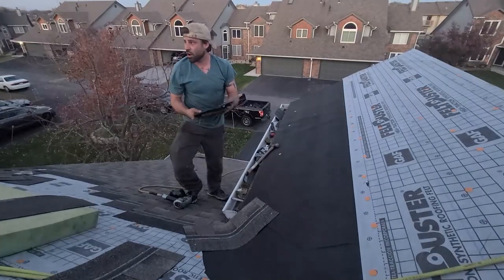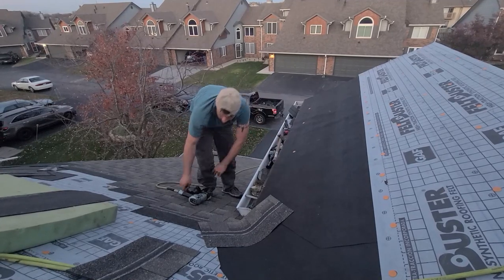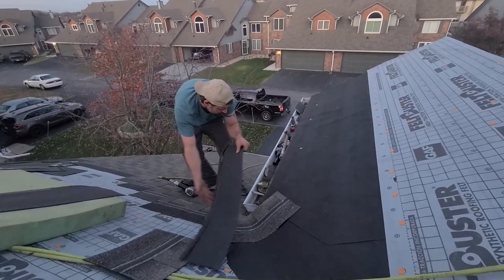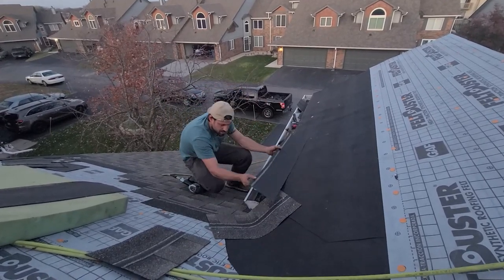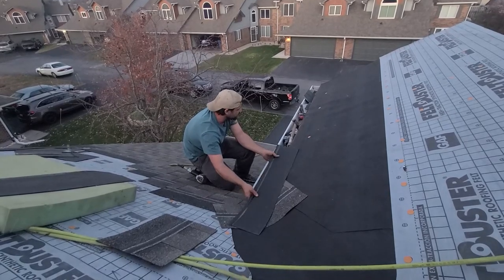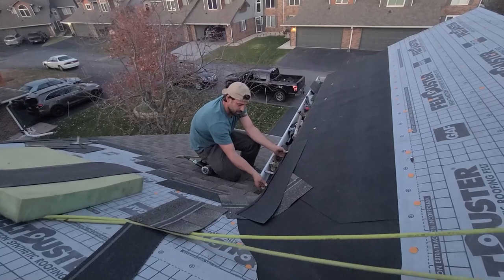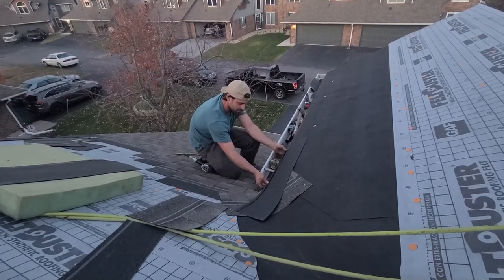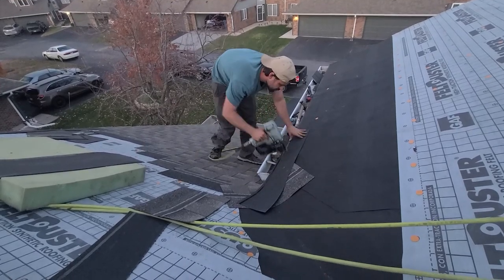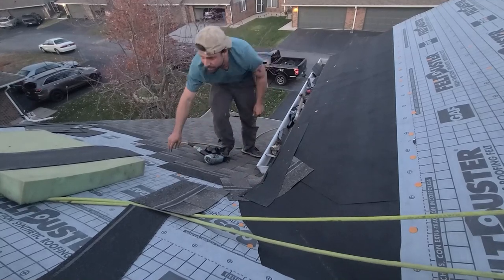All right. I need those starters. Give me a few starters. All right. Over there. Nice. One more, at least. Okay. And I'll throw this up in the valley a little. Ah, shit, gutter apron. What a douche. All right, no gutter apron. I'll just nail high, we'll come back and slide it under. I made Brad do it over there, and then I just go ahead and nail.